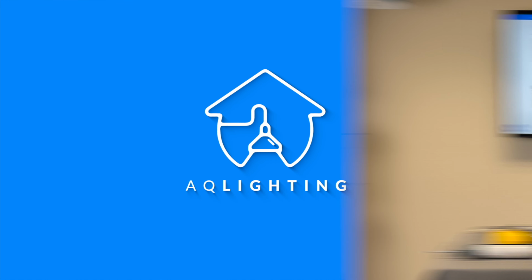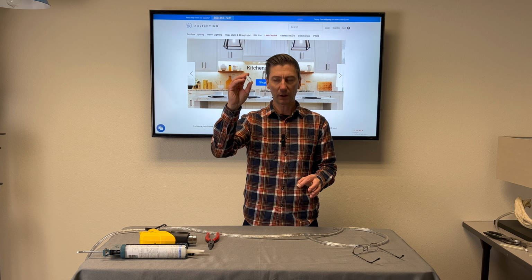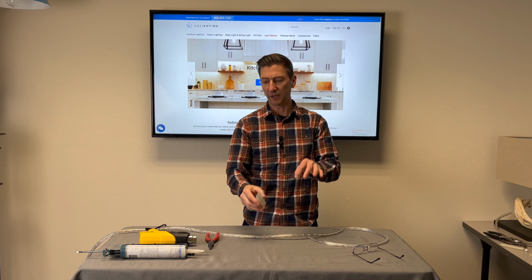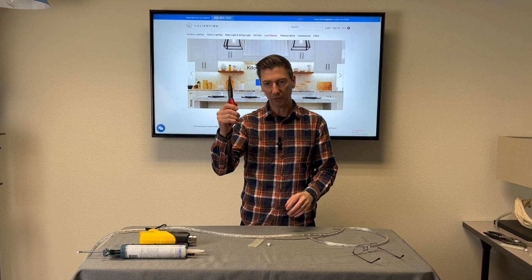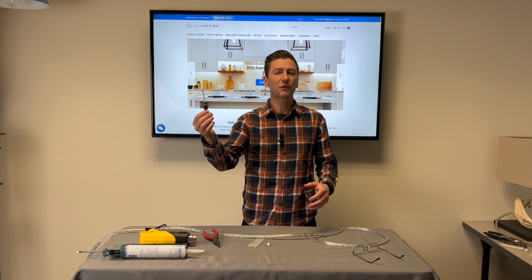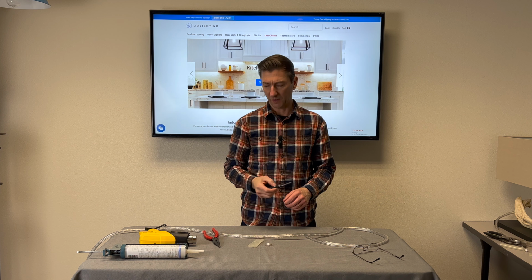This is the invisible splice connector. It does definitely require a piece of heat shrink. So once you install it, you slide the heat shrink over it, heat it up, shrink it in. I like to use a pair of pliers, and also I like to have this little screwdriver that we've sharpened into a point to help pre-poke the conductor wires.